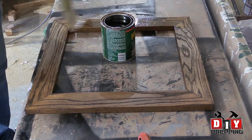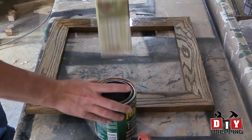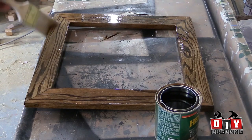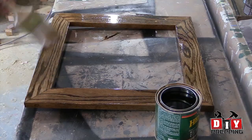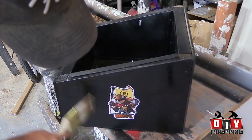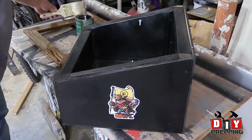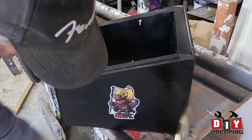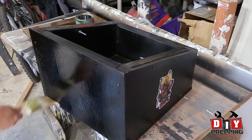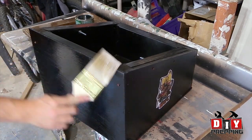With the polyurethane, I applied two coats. I applied one coat to the top edge and bottom edge - the bottom doesn't matter all that much, but the top edge you want nice and clean. After this dries - about eight hours - you sand it down and do another coat. While I was at it, I did the box as well to give it a more finished coat. It also helps keep the sticker on there so it's not starting to peel off in six months. Two coats on all four sides of the box really gives it a finished, nice look.